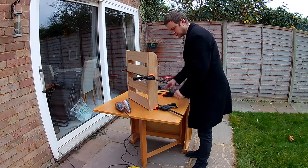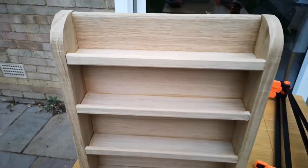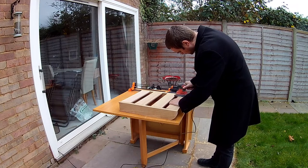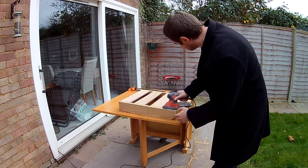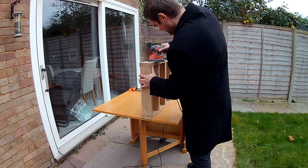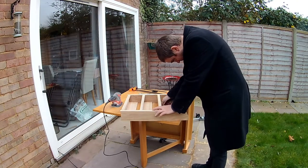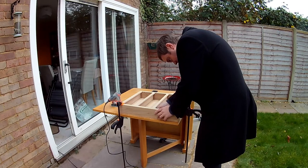After the glue all set, I took the clamps off again and had a good look at the piece. There were a few things I wasn't completely happy with, including what I think were scorch marks from the router on the side pieces, some gaps in the joins, protruding shelves, more gaps, and dried glue marks all over the place. There were also a few dents from overzealous router work in a couple of places. Time to start tidying it up. I gave it a thorough sanding, which cleaned up the dried glue really easily and effectively and hopefully helped with some of the protrusions and dents. The big flat areas were easy and cleaned up very nicely, however getting at the internal edges was much harder.